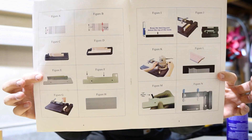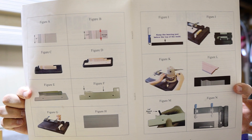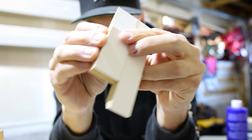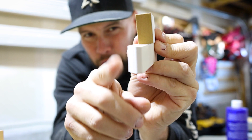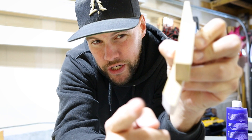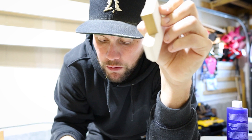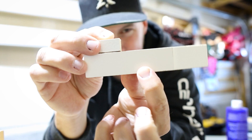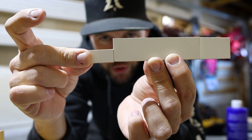Let's play chemistry — or biology, or some sort of science. I feel like this is something we should read the instructions on. They actually have a really good diagram with pictures on the instructions. The first thing it says to do is cut a one-inch piece of baseboard, which is what I did. Then it says to take another piece of baseboard and cut half an inch off the bottom. My baseboard has a bevel on the back because the people that made it actually know what they're doing — the bevel helps the baseboard sit flatter on the floor. In this case I've just cut the bevel off. This bottom piece is gonna sit in the mold and this piece sits at the back so the router can just drop down into this off-cut and walk the profile appropriately.